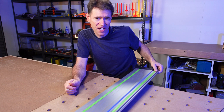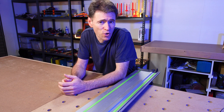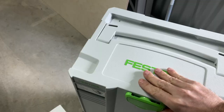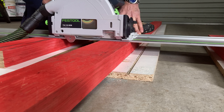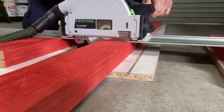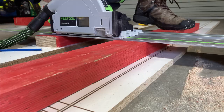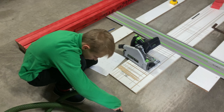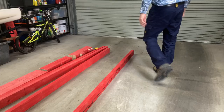It's really versatile - it moves around in my small workshop and it's been really great to work with. Let me show you how I made it. It's basically two ladder frames supported by four legs, 2400mm long and 780mm wide. This means a lot of simple marking out and plenty of track saw cuts. I was surprised at how well the saw cut through the deep section whilst balancing the track on the narrow beams. Not much dust either, but any excuse will do for my son to use the vacuum - clean as you go, right?